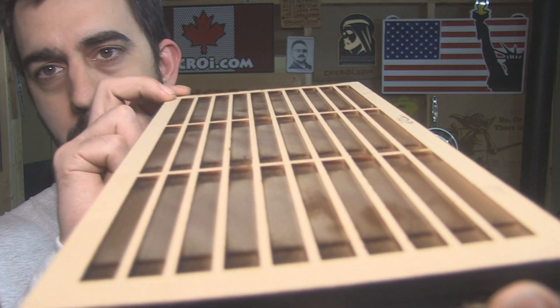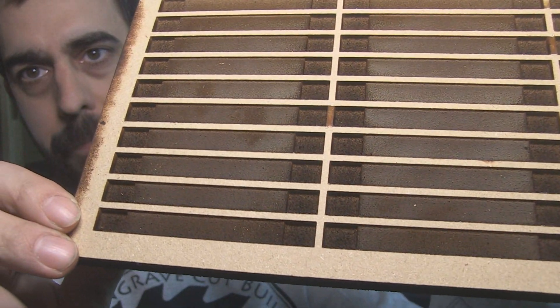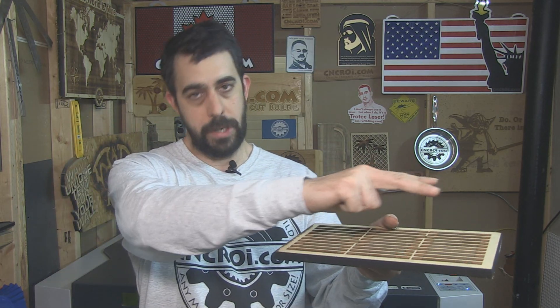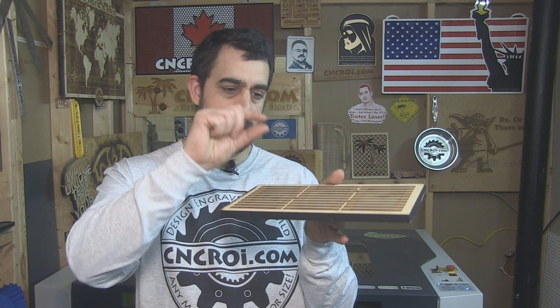But if you look here, you can see that everything is actually the proper depth. Now, the one challenge with laser engraving is that it's not a two-way feedback system like we have on our CNC router. On the CNC router, we can say bring the bit down one-eighth of an inch and carve everything one-eighth. We don't have that with the laser — the laser doesn't know what it's doing. All it does is based on speed and power, so if I want an exact depth, I sort of have to approximate it and keep engraving until I get that.